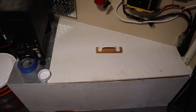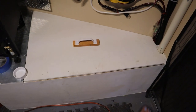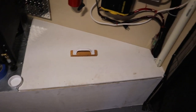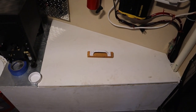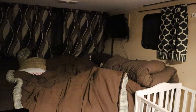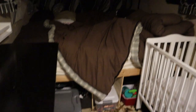Hope you guys enjoyed the video — give us some tips or advice if you have any. I'm hoping this will eliminate the issue of fumes or gas from those batteries when they charge from coming into our living space — that was the whole intent. We're using these batteries to run a CPAP at night, and we have a 12-volt flat screen TV/DVD combo we may run for a few hours in the evening, mounted on the wall, as well as a breast pump a couple times a day and charging cell phones and batteries.